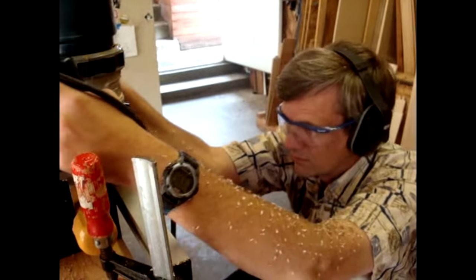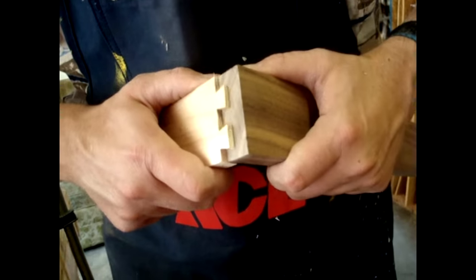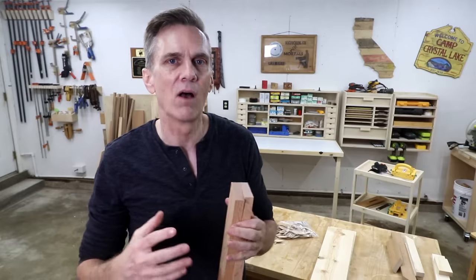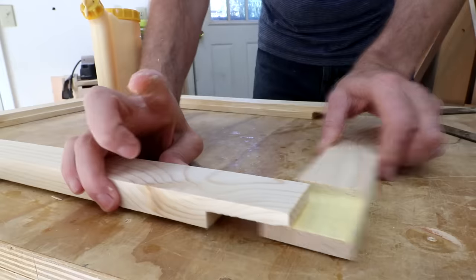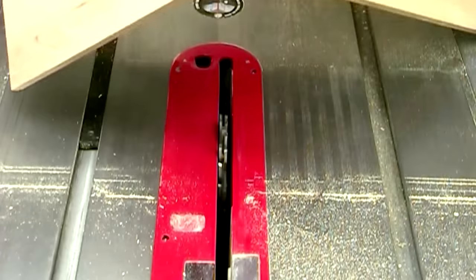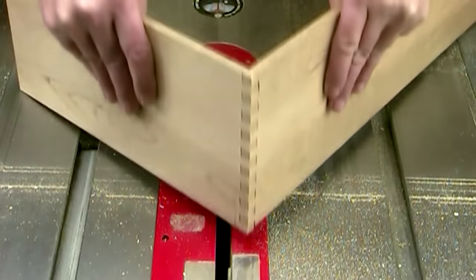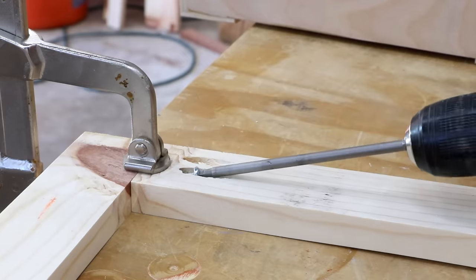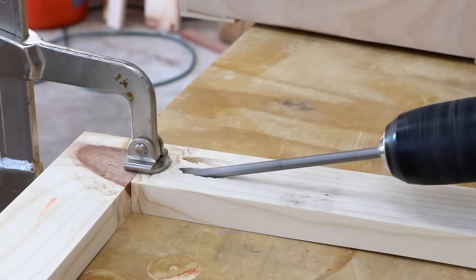the wood in such a way that physically holds the pieces together, like dovetail joints, or by cutting the wood in a manner that allows face grain to contact face grain, such as a lap joint or a box joint. In my woodworking for mere mortals method of woodworking, I prefer to use pocket screw joinery in projects where they won't show, and lap joints where they will show.